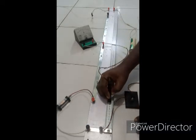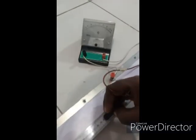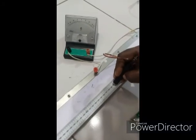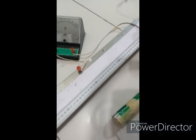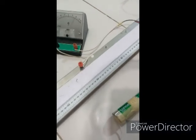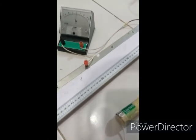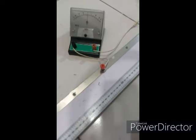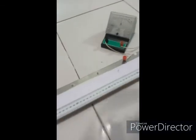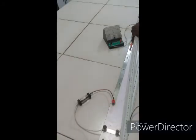I'll tap from 10, with full-scale deflection to the right, moving along until we get to the zero center — at 70, 80, 90, 95, 96. At 97 the balance point has just passed, so it is around 96. You can see that 96 is the zero point — so the balance length is equivalent to 96. I'll now bring my meter ruler back and measure out another length.